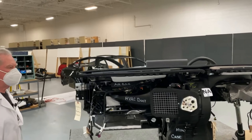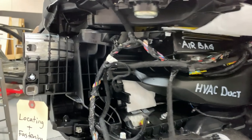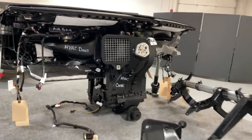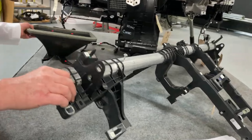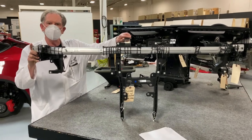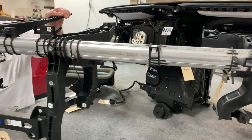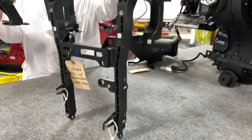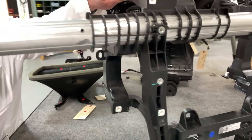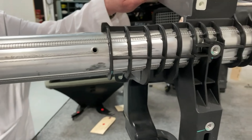So let's move on to looking at this part right here. It's very difficult to see, but this is called the cross car beam. The cross car beam is essentially the supporting member for everything inside of the instrument panel. This is the cross car beam that Tesla had in the Model 3 — identical to the one inside here. We know that because of the tag right here beside me. It's called out as the J-Clinger module — an over-molded piece of aluminum. You take the piece of aluminum, put it into a mold, shoot the plastic around it, and that's what basically holds this together.